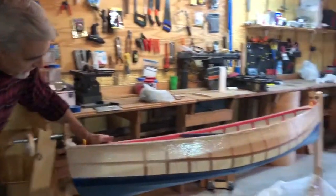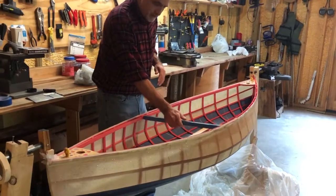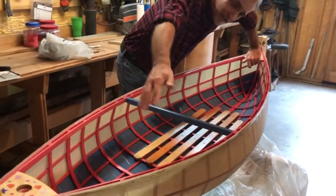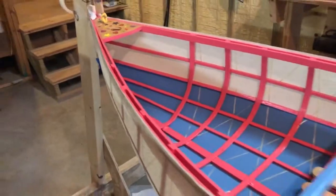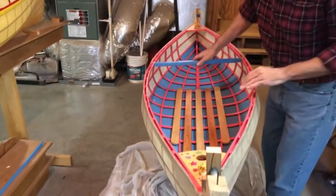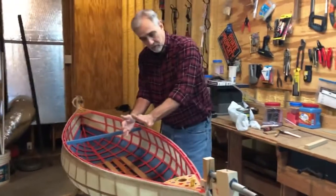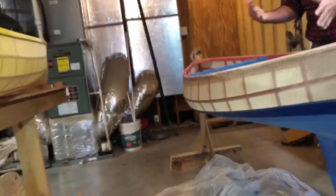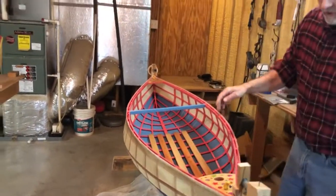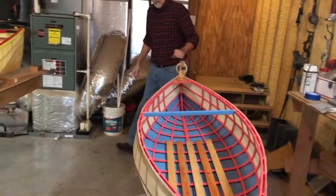This is my little boat for my five-year-old granddaughter. If anybody asks what type of boat you build for a five-year-old who is convinced she's a princess and plans on riding a unicorn someday, this is what you'd build. If you look at this boat, it has a lot of what's called tumble home — it curves in quite a bit — and it's also got a very wide belly with a pretty severe bend. It's got some rocker on the bottom, a wide belly, and a lot of tumble home. So you're taking a flat piece of material, trying to bend it in three dimensions and get it tight. And you can see it's fine — it's very tight, came out very well. If you can make that material fit a boat like this, you can make it fit a standard boat.